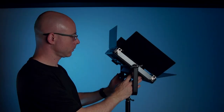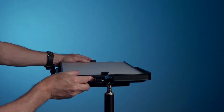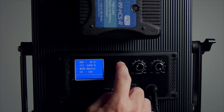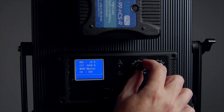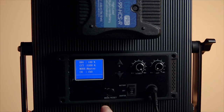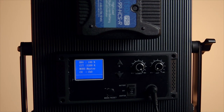This light mounted vertically on a light stand — you can actually tilt the barn door to a certain degree. But if you need full tilting control, all you have to do is set the light to 90 degrees because it comes with a dual-way spigot, and then you have full articulation of the barn door to any height you want. Here's the back of the panel which is self-explanatory. The channel numbers correspond to the plus and minus buttons — it goes from channel zero all the way to 11. Over here is your brightness intensity knob, which goes from 10% minimum in 1% increments all the way to 100%. Here's your color temperature that goes from 5600 Kelvin all the way down to 3200. This button here controls several features such as master, Wi-Fi, rotate, slave, and back to master, and also a Wi-Fi reset. If you forget your Wi-Fi password, you can simply hold this for 5 seconds and it will automatically reset to factory.